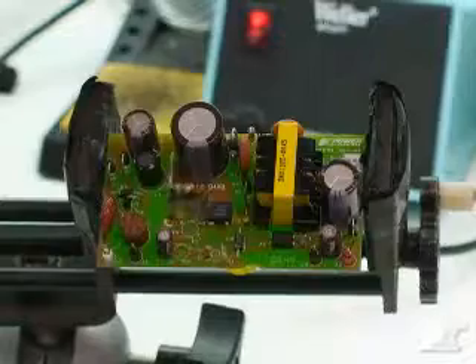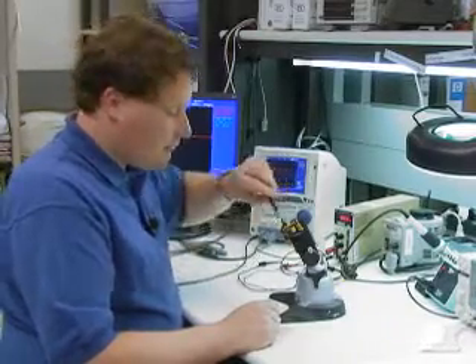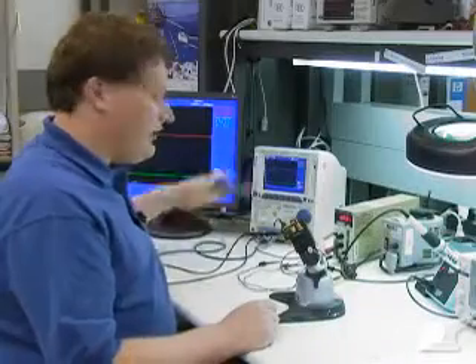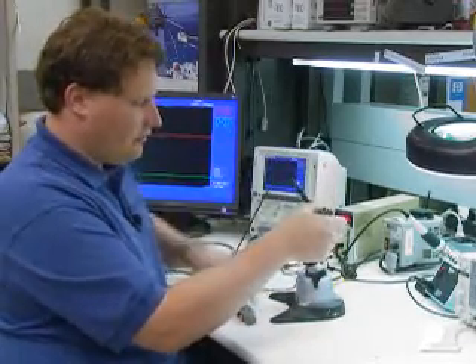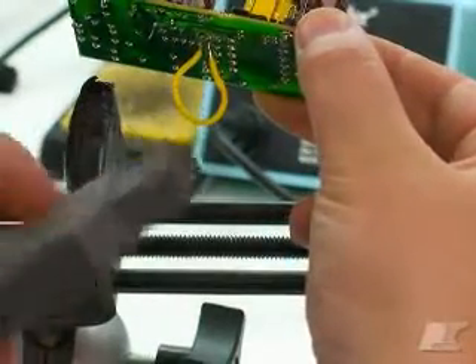I'm going to put the ground clip of the scope probe to the source pin connected copper area of the TinySwitch 3. Then the scope probe clip goes onto the drain pin. I could have connected it to the drain pin directly, but as the drain pin also goes to this clamp diode, I'm going to hook it on here — it's just a little bit more convenient. And then the current probe is going to go through the loop that we soldered on earlier. The current probe has an arrow on it, so I need to make sure that points towards the drain of the device.